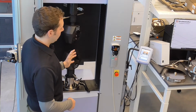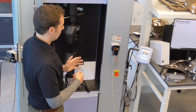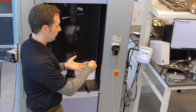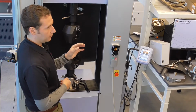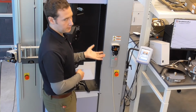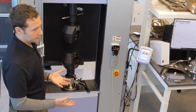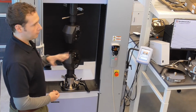And the main point behind that is that, like I said, all the data is connected in that cable. When you plug it in or unplug it, there's a tendency for a small arc to happen between the connector and the plug itself. So this is similar to how if you plug in your auxiliary connector, your 1/8 inch, into a car stereo or other type of stereo, you're going to hear a little pop. That pop is actually a little electric arc going from the socket to the connector. The same thing would happen with this as well, except that arc is enough to clear or damage the data. So that's something that we like to reinforce: do not have the frame on when you're changing the load cell cal cables. If the data were to be erased, it would require a Shimadzu representative to come out and recalibrate the load cell.